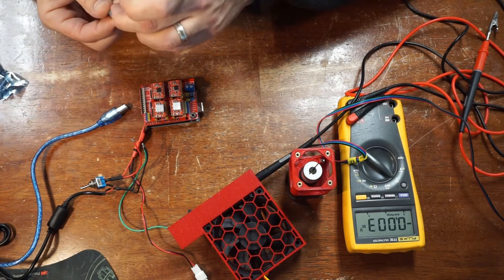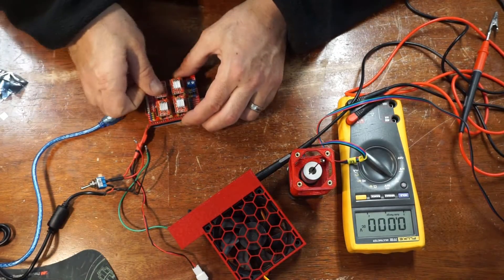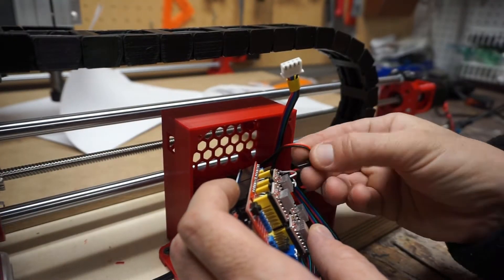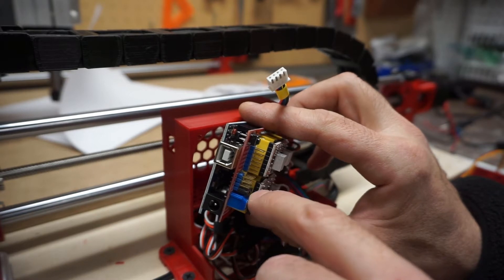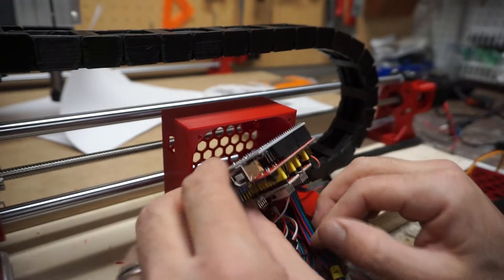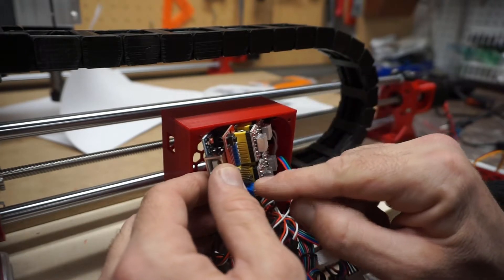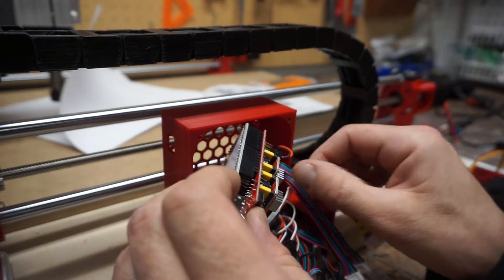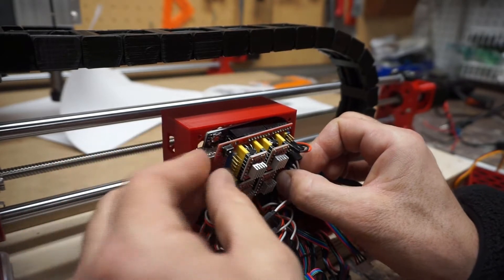For a while the motors weren't working — it was really disheartening. I messed up with these other jumpers over here. I'm not duplicating the Y to there; I'm actually adding another Y, so dual axis. There's a config for it and we're tying pins 12 and 13 to that driver. To get these in, I should have put the Arduino in first and then added the things.